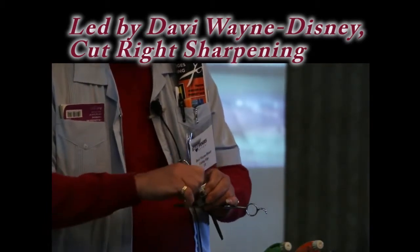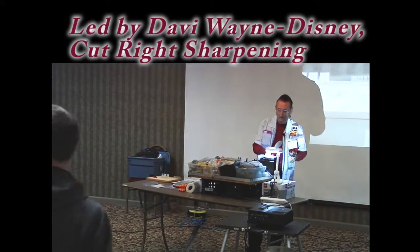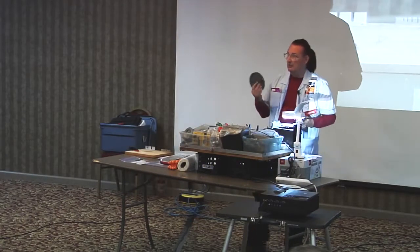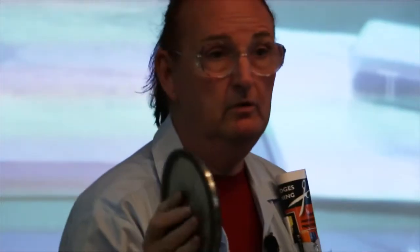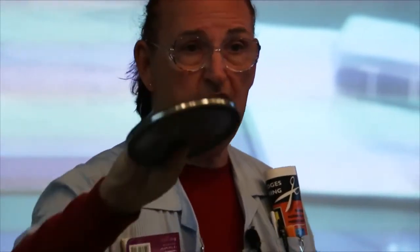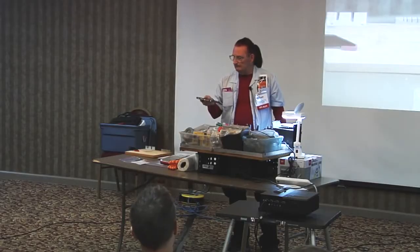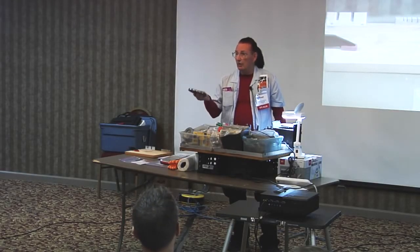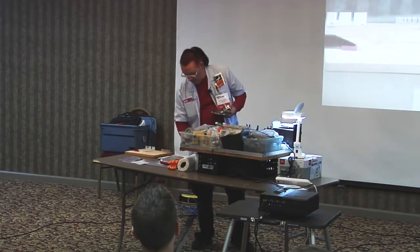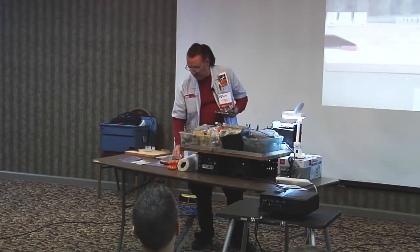Can you tell us a little bit about this wheel you're using — National Diamond Lab? It's diamond plated. It's 3/8 of an inch thick, and the diamond is an 1/8 of an inch thick. It's going to last you forever, unless you do something stupid like drop it on an edge. You have to call them for a quote. It is a modified 6A2C grinding wheel.